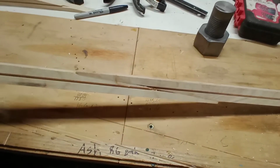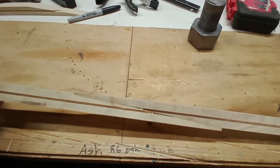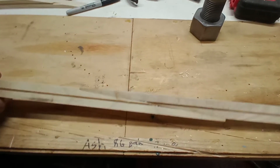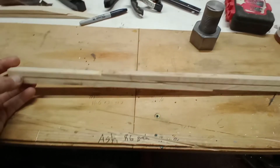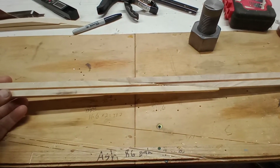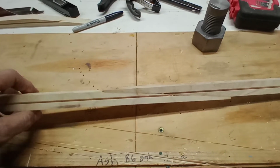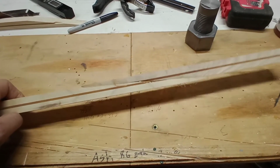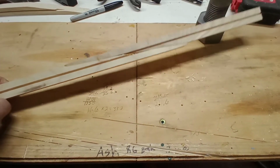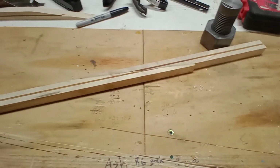And of course, I forgot about the scarf joint. We're still trying to break the wood beyond the glue joint, which is real easy if it's a softer wood, but I'm using this really heavy wood, commercial white ash, which is, in some moduluses, for some of them 6 times stronger than the other woods. So that's why I'm having trouble getting it to break before the glue joint.